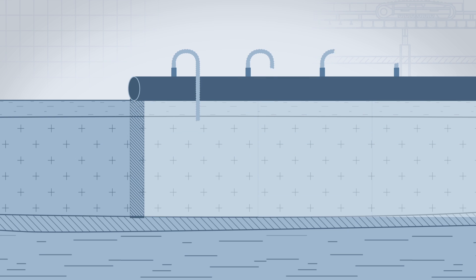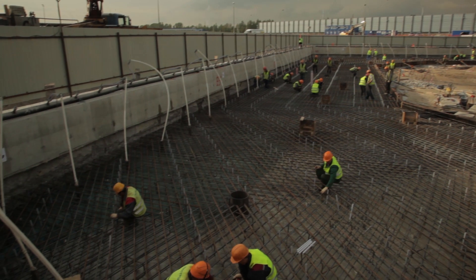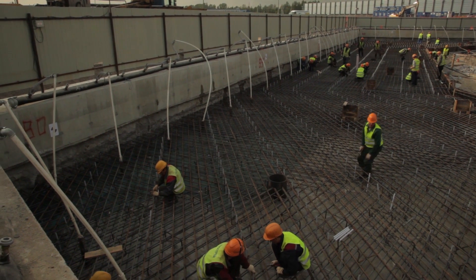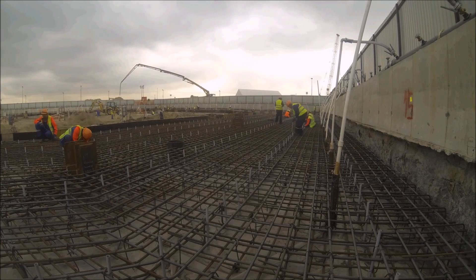The well points are lowered into the soil at a depth of 4 to 5 meters. Water is pumped out through them from the upper water-deposited aquifer locked in the D-wall. In the lower, firmer clay there is practically no water and underground water does not ingress into the pit. The D-wall does its work and the pit bottom remains dry.